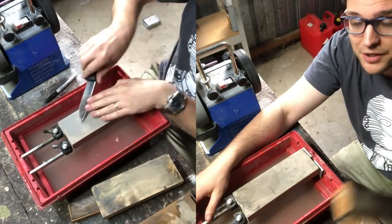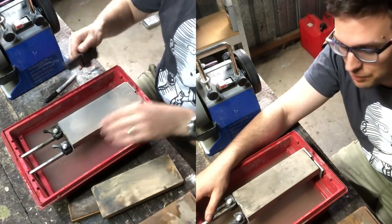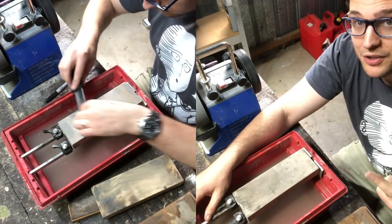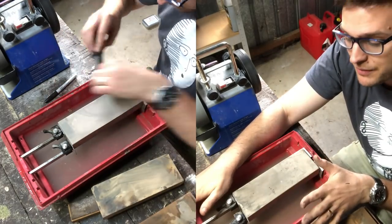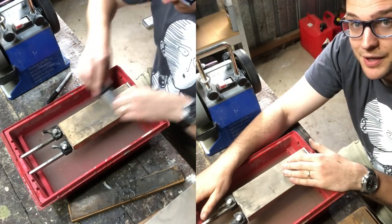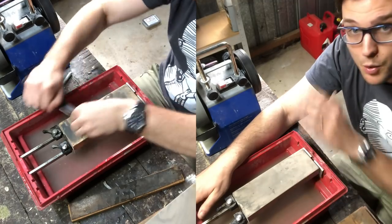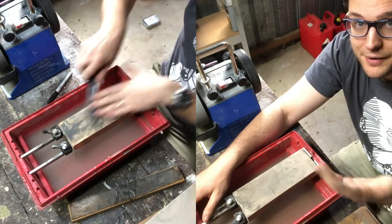Compounds roughly translate into grit finishes, generally between 3,000 and 200,000 grit depending on the formulation. Results-wise, stone sharpening is probably equal to the KME — if not better, since some skilled sharpeners will beat the KME with stones. I'm a C student with stones — I can probably match my Work Sharp edges, but I haven't sunk enough time in to say I'm excellent at it yet. I recommend checking out Michael Christie, We Defend, and Big Brown Guy for stone sharpening expertise.